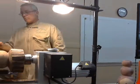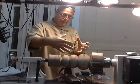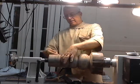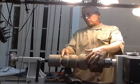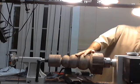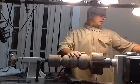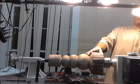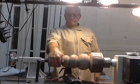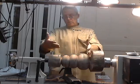While this is still pretty flat here, I'll clamp this with one of my clamps, and I'll turn this upside down. I drill so far through the bottom, and then I come up here. Usually I have to get a smaller drill bit, and then I'll drill down so far, and it only reaches like this one. It wouldn't go all the way through. Then I've got a long bit that's about 1 inch in diameter, and I'll drill down as far as I can. It takes most of the wood out, and it keeps it from splitting so bad. But I try to get some of it out.